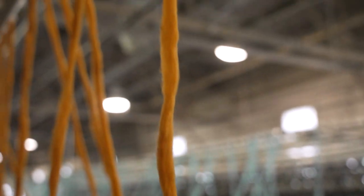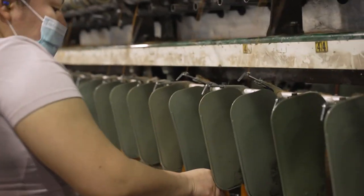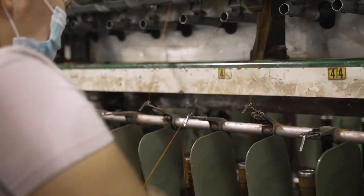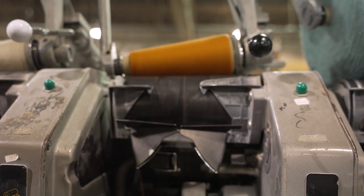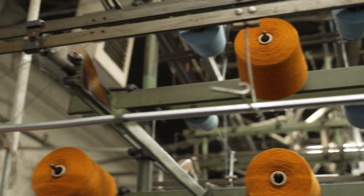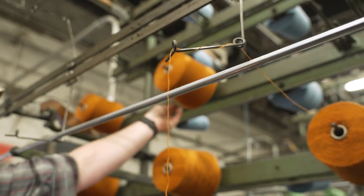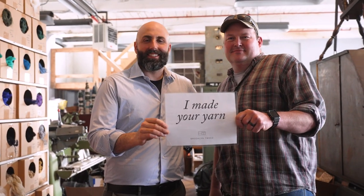After the card, we take the fiber over to our auto-leveler or servo, which is the first step in drawing — making the fibers more and more parallel and the fiber more and more even. The second and third steps again make fibers more parallel while getting it down to a thinner diameter, ready to spin. As the fiber comes off our finisher, we take it over to the spinning frame, lace it through a series of rolls moving at different speeds, pulling the fiber apart and getting it to the final diameter and weight. The difference in speed between the last roll and the spindle below is the twist ratio — that's how we add twist to the sliver and make yarn. For Brooklyn Tweed, we're specifically making a five-ply, which is unique for us and makes a very nice worsted weight yarn.